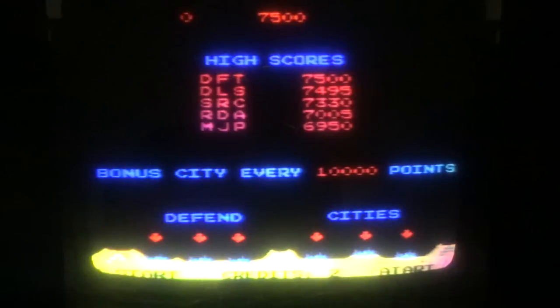You can kind of tell by looking at them. Once you've seen it a bunch of times, you see the tube, and then you go, that one's not going to brighten up too much. So I hit it with the rejuvie, and it made it a little better, but this is not a new old stock tube, so it's worn, but it looks all right. When you're having focus problems and it's the tube, a lot of times it's not going to get too much better. That tube's on the way out. But it'll probably stay like this for 15, 20 more years if you just play it in a home environment. And if you put an LCD in it, it would look like crap. This is really the only way to go.